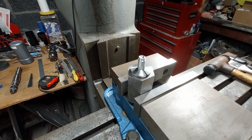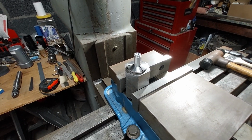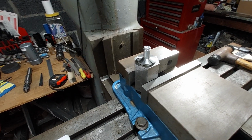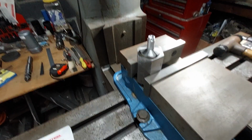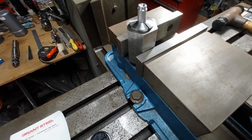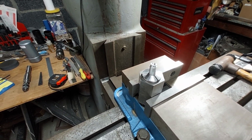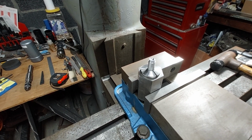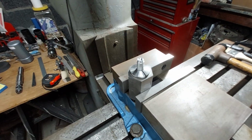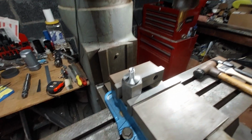I've actually done that. I used that feature when I was modifying the idle wheels on my 1/6 scale M5 Stewart. Because the idle axles, everything on that was tapered so that the plastic could come out of the mold. So you've got a tapered axle, the hole in the wheel is tapered, and it's plastic on plastic. So I drilled out the wheels and bored it out so I could fit a piece of 1/2 inch copper pipe, the kind you'd use for a water pipe, which was all I had on hand. I opened up the wheel to fit the copper pipe, and I could machine the axle so it was a straight diameter, and the copper would be a nice slip fit. So a boring head is a great tool to have if you have a Bridgeport.